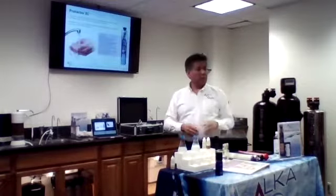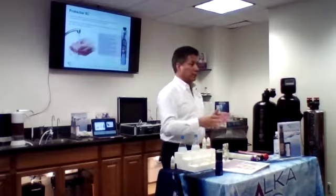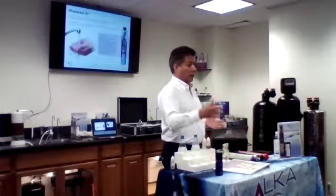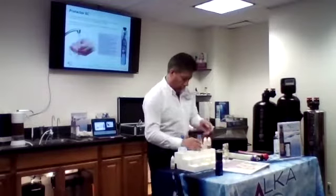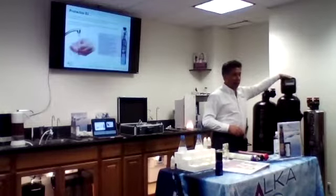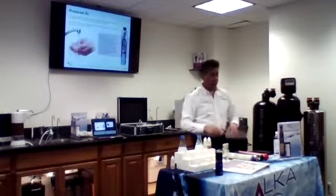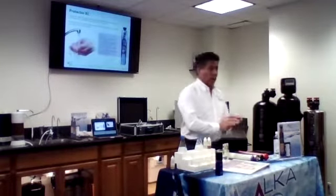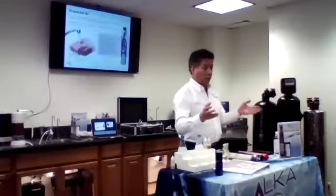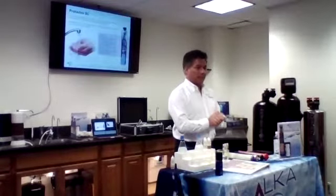There are some big houses that have high flow faucets for their jacuzzis, and they want to fill it up really quick. You don't want to use the smaller system, and the pressure will reduce. So you have to talk to the customer. If they have no high flow valves, the regular system will be fine.